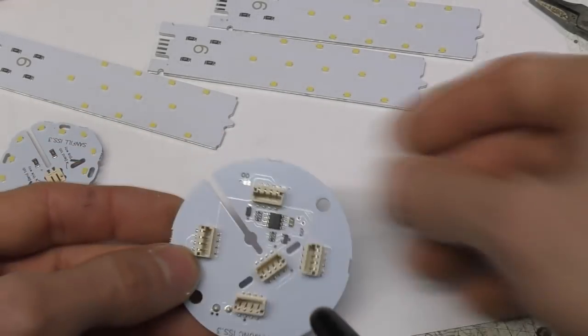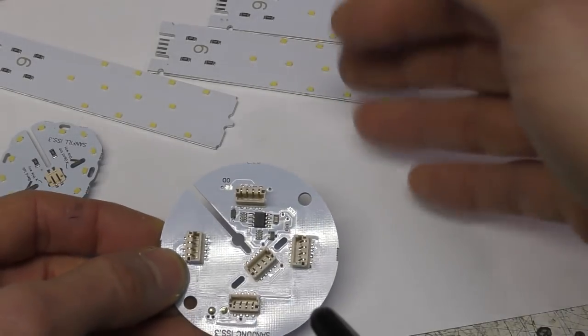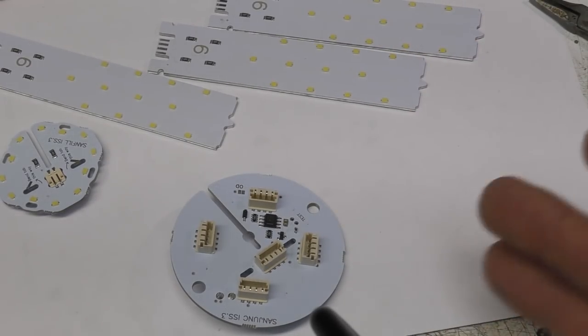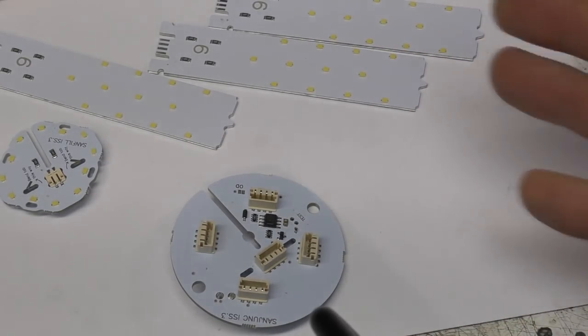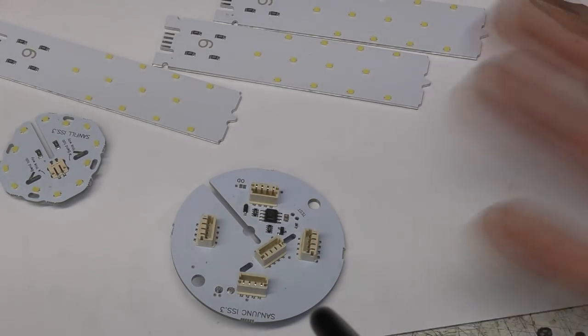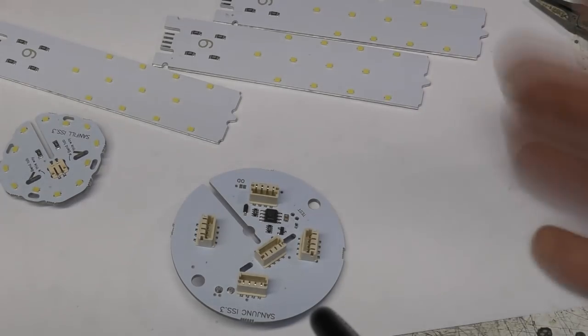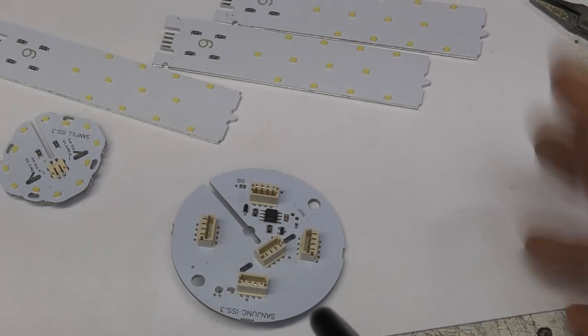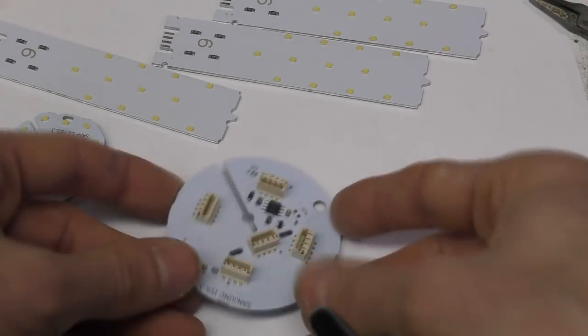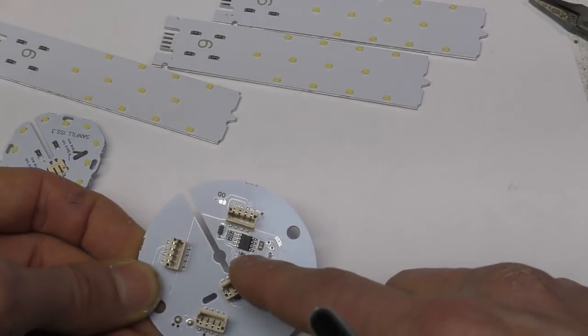Now on this bottom board, this is a very simple circuit. It's basically 24 volts in, but because it wasn't designed to be able to run at 100% duty cycle, we needed some way of protecting it. Although the content will be designed to not run any particular fixture for more than a certain amount of time, we couldn't really predict reliably exactly where the point is where they got too hot. So there's actually a thermal limiter circuit on here.